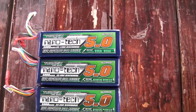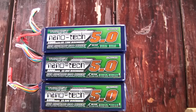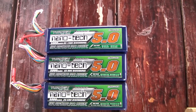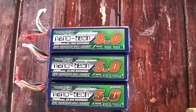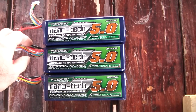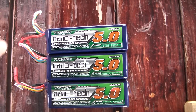Typically across all these packs I might have seen an error of about 0.05 volts per cell. I charged it up — the first charge took maybe a little bit longer than normal to fully balance, and then the break-in flights ran pretty smooth. They all discharged very well. I'm not going beyond 20% discharge, which is one thing that really helps with the lifespan of your pack.